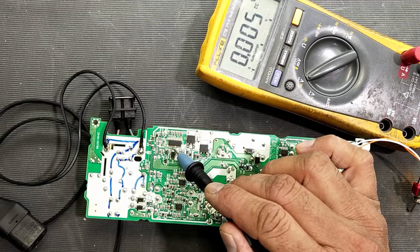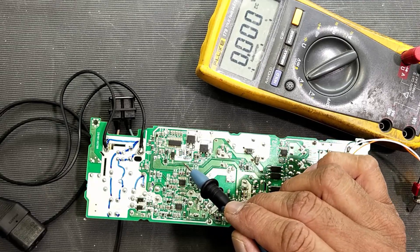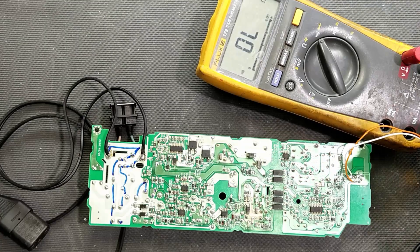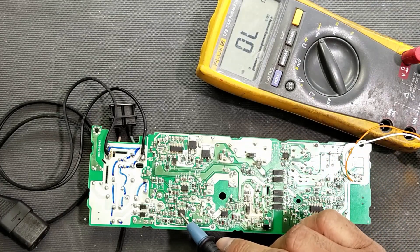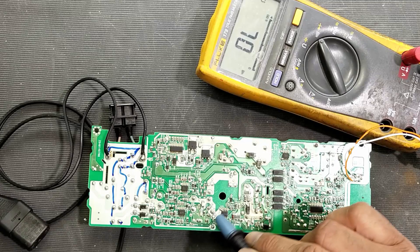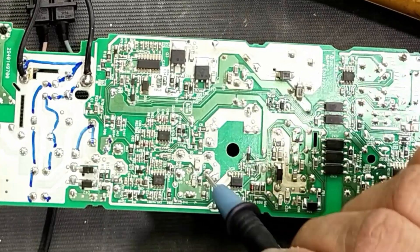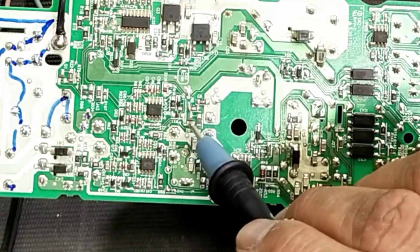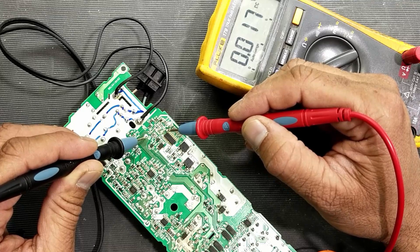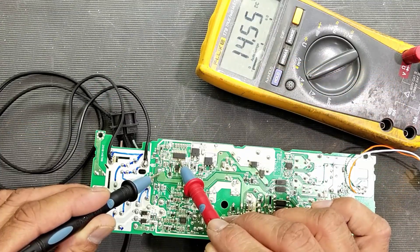This gate is connected to IC pin number 15 and pin number 11. When we turn on, it receives a power-on command and the PFC will start working, maintaining the voltage. We sense the voltage from the resistors — one, two, three resistors — VCC voltage at pin number 12, so we will receive 15 volt VCC.